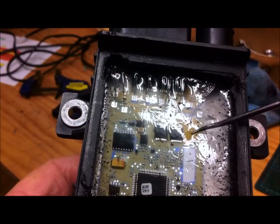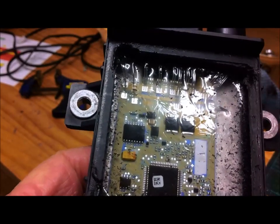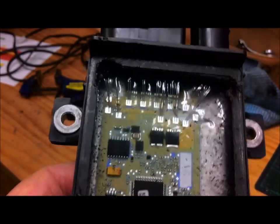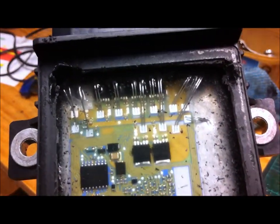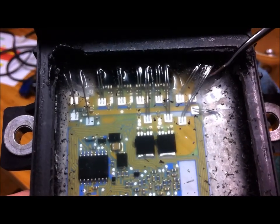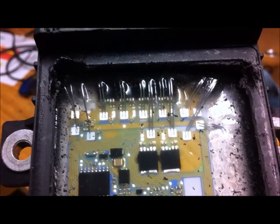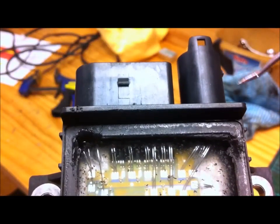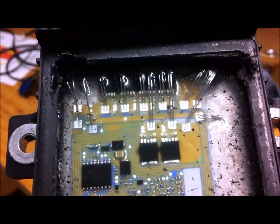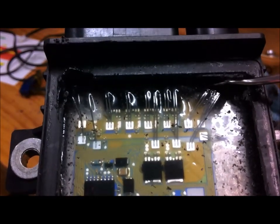The inside of the control unit is filled with a very soft electronic potting compound, usually made out of polyurethane or silicone, so it's very soft and quite easy to get out. What happens is these three aluminium wires that take the 12-volt power from this terminal down to the circuit board — those wires fracture right at the end where they are joined onto the copper terminal.